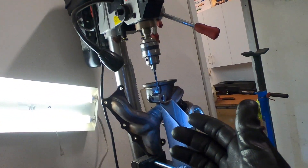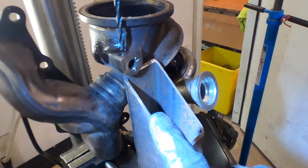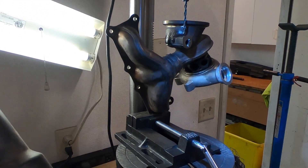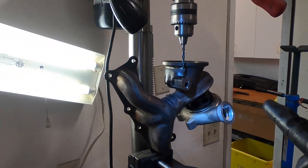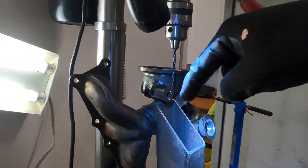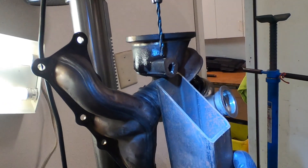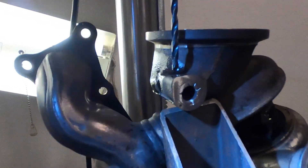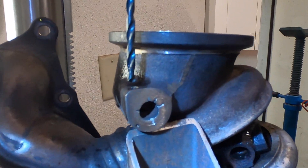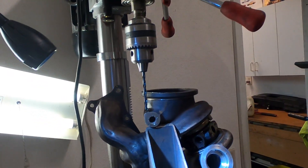What I thought was going to be a really easy drill has actually been very difficult. This is hardened steel — I think that the pin inside of here is made out of hardened steel. It is really hard. So what I did was rig up the drill press here with the whole assembly in my vise. I covered it with a rag and I've got a piece of metal here for additional support — when you push down on this cantilevered location it's going to end up twisting, and I don't want it to twist. I've got the bit coming in squarely into the piece and hopefully the drill press is going to give it a really nice square hit right straight down into it.